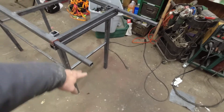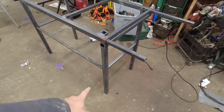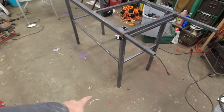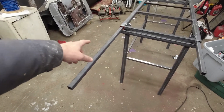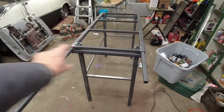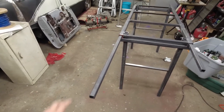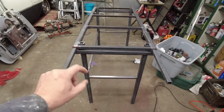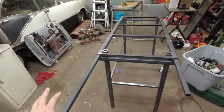I'm not a hundred percent sure how to do that — I've got an idea but we'll see if it works. Then I want to start on, if not build completely, the mechanism for lifting it up onto casters so I can move it around. This is going to be very simple: I'm just going to hack off some two-foot lengths, two pieces slid in from each side because this is four feet, and a piece of the same heavy-duty L channel welded across. That's literally the sum total of the construction.